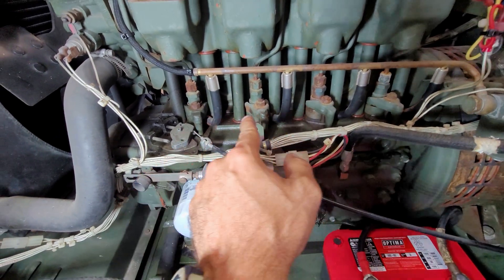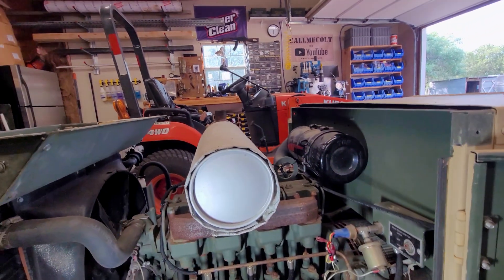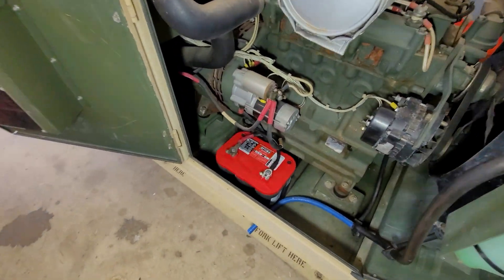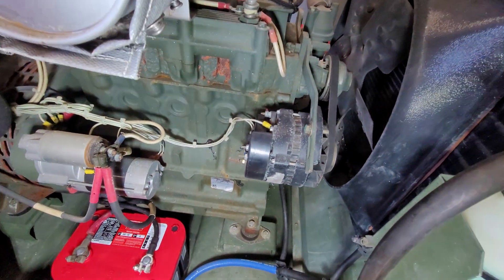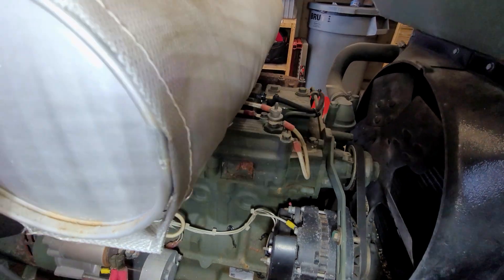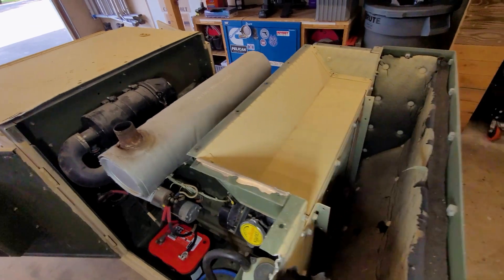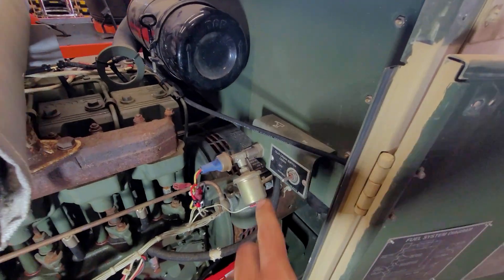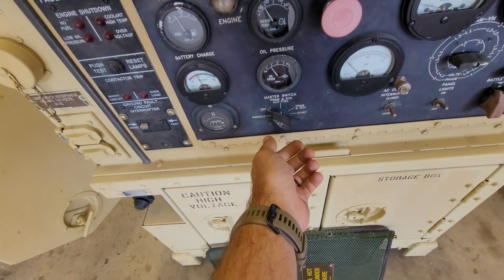That's probably the reason why along the engine block here it's all wet. I cleaned up a little bit, leaving the top cover and all that stuff off, and banged that stuff out. On this side you can see the batteries in here — the belt is tight, the missing hardware is addressed, the alternator's mounted back up, and you can kind of see where the fuel return line is. My first expectation is that everything should work — I'm going to move it to normal and give it some power and let it prime for a bit.